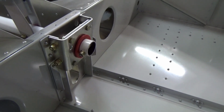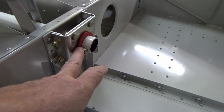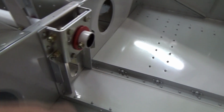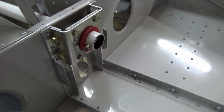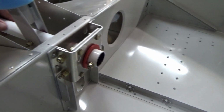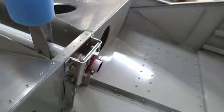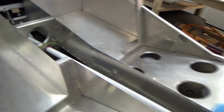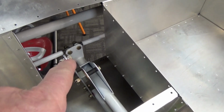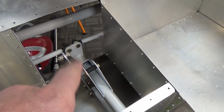Alright, just for peace of mind, not sure if I need it or not, I've put that, that's a 3mm bit of chopping board, but I made a nice washer, slid it on, and controls are still full and free, but I haven't got that end float anymore, so I can sleep well. And then I'll do that rear bearing support, which goes behind those two, in behind that bell crank there.